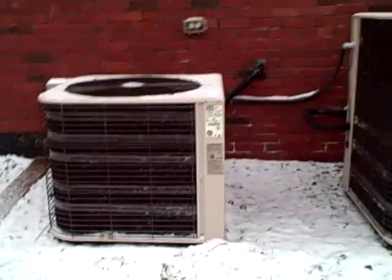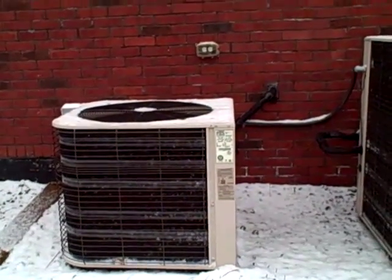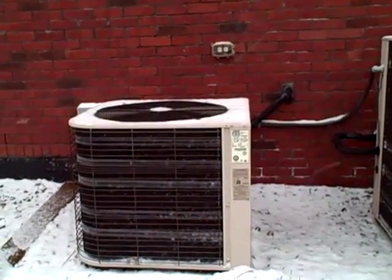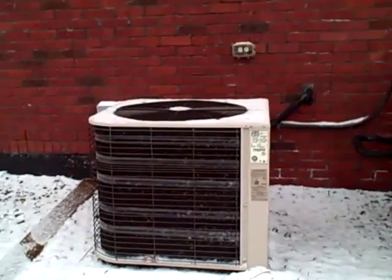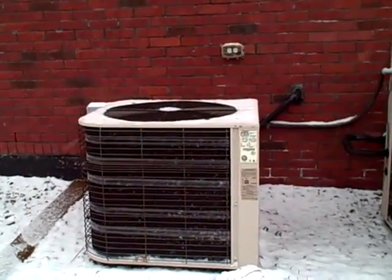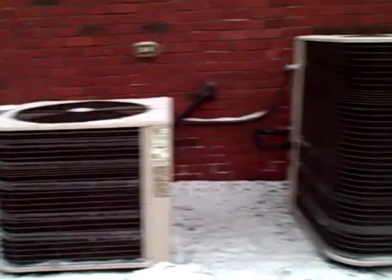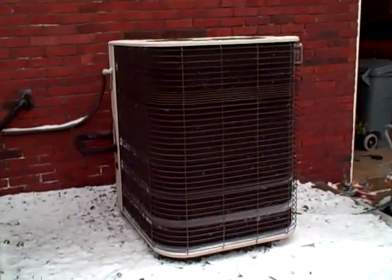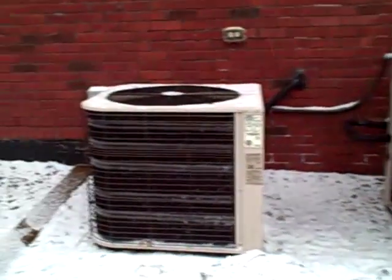One interesting note, if you look at the model numbers on heat pumps and you see a 36, that would indicate a 3-ton unit. It's typically 12,000. Every 12,000 indicates 1 ton. If you see a 42, it's 3.5 tons. So that's just one way that you can look at your heat pump or the house that you're looking at and get an indication of the size of the unit.